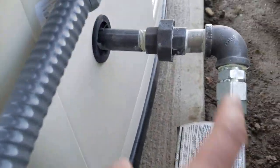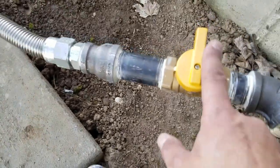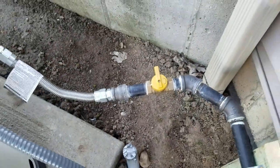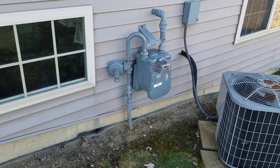It's turning out really well. There's a drip leg inside on this generator so I didn't have to put one there — it's already inside. Nice big one-inch gas valve. There should be plenty of fuel — the main gas meter is right there.